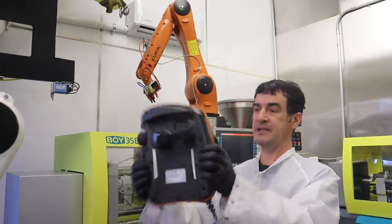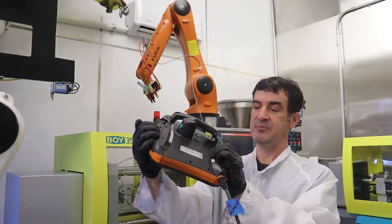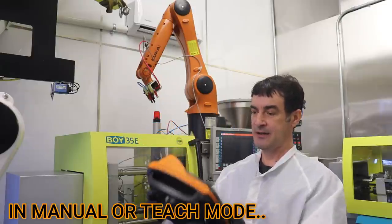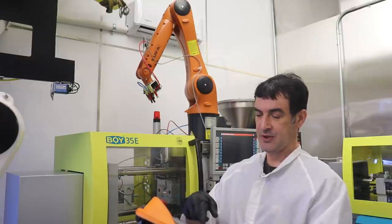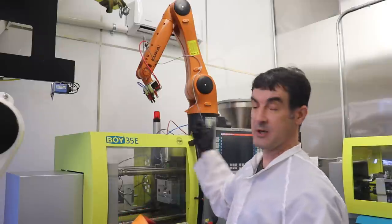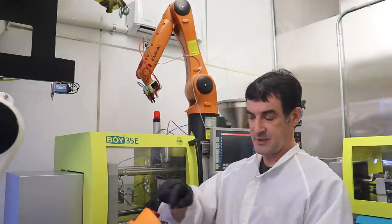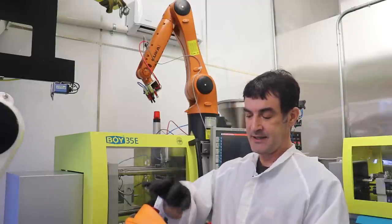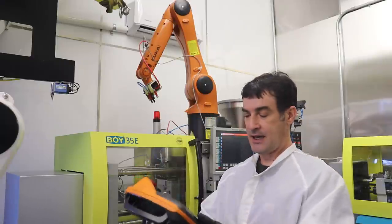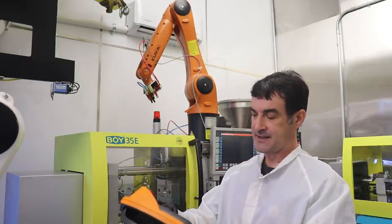Basically, this control pendant has panic bars on the back, and you have to hold this button in the middle position to actually activate the robot. The controller has a few operating modes. Right now we're in automatic mode, so this robot is ready to run once it gets a signal to start. By flipping a switch here, we can also go to a teach mode. In teach mode, this controller is basically a big joystick, and after you hold down the panic button and you see that the axes turn on,